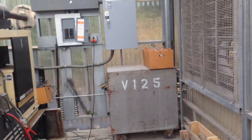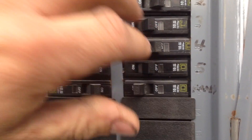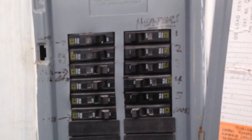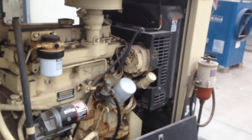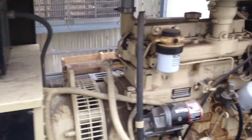One, two, three, four, five — go ahead, turn them all on at the same time. Let's do the smoke test. Here we go. Yeah, no problem. Check the hertz — that's perfect, right where it should be. I'm going to let this run for a while as it hasn't been test run in several months, so let the blowers run, keep the load on the generator, see how it does.